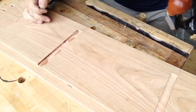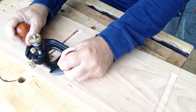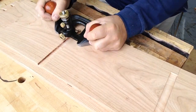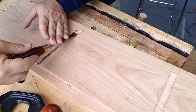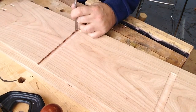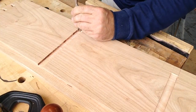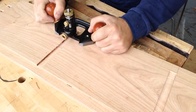Now that that's done, just flip those out of the way. If you've got any inconsistencies at all in the corner, I come in with a router plane. I've got a little bit more to clean up here, so again I'll come in this way - chop down here, chop cross grain, then long grain, and then the router plane to lift it.